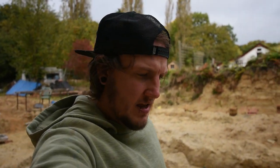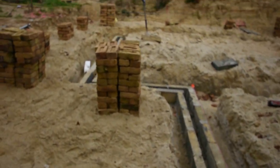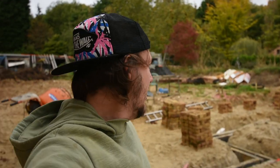I'll do me for the day, let my shoulder rest. A little bit of a late start today - it was raining this morning. You can tell just how wet it is, it's drying out now. But I made one of the biggest mistakes any builder or bricklayer could ever make - I did not cover my bricks, so they're all wet. Every single stack is wet. With wet bricks, if you lay wet bricks there's a chance you can get what's called efflorescence - the salt in the mortar and the bricks comes out and it looks like white crystals on the brickwork. Don't lay wet bricks.